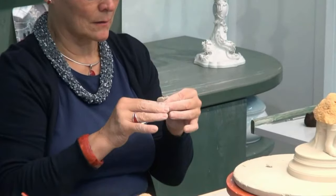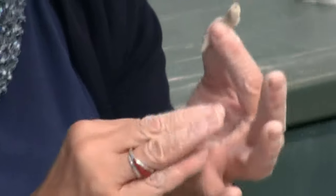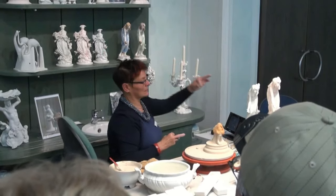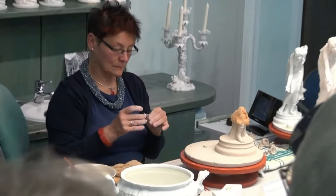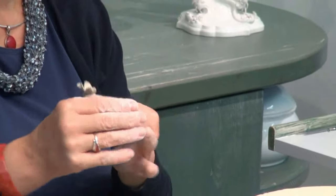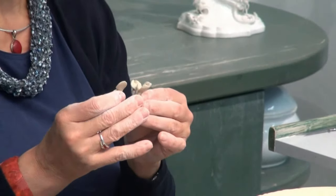As we've already explained, after drying, the porcelain is subjected to a first light firing, to be followed by glazing and smooth firing at 1400 degrees Celsius. The porcelain body shrinks in the firing for a second time. All additional painting, colors and gilding is then applied over the glaze and fired at a third burning in a muffle kiln at a temperature of about 900 degrees.